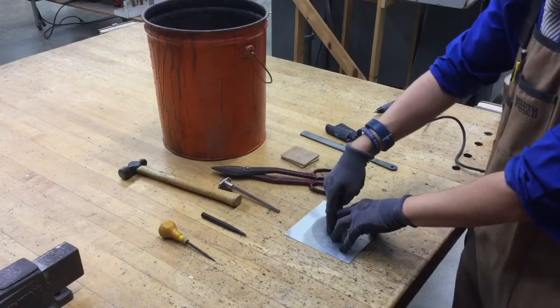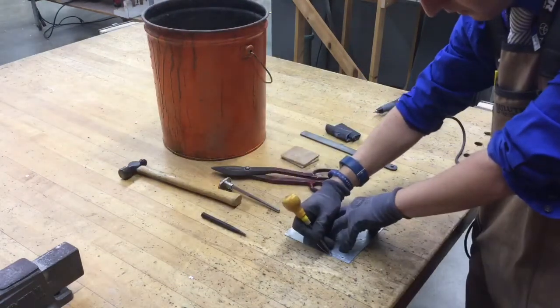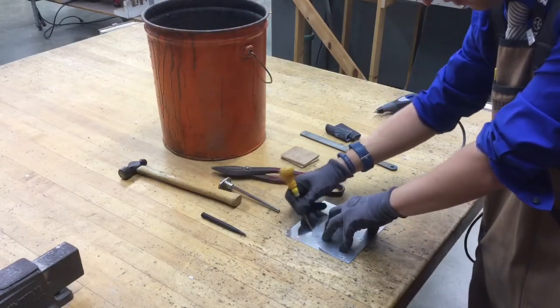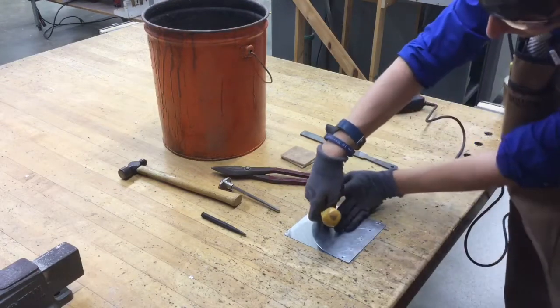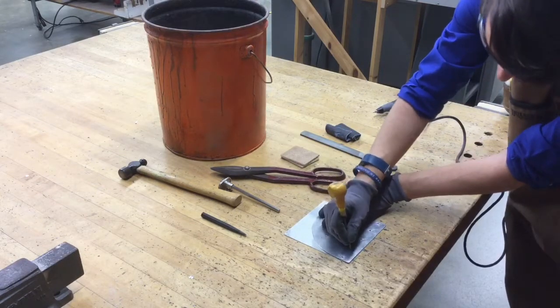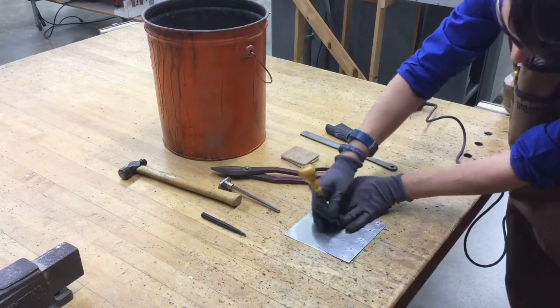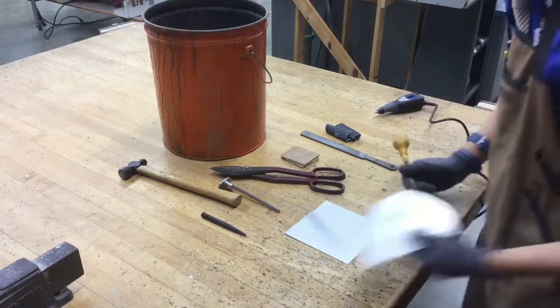Keep your hand planted in the center so nothing moves and keep some even pressure. Take a scratch awl, and scratch around the outside perimeter of this half moon shape. And then we also want to move our hand and cover these holes as well. There's 5 total holes in the bottom. Trace out all those holes the whole way across, and try not to move your template.